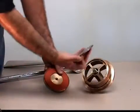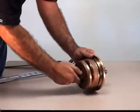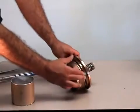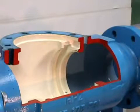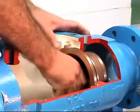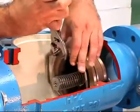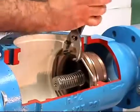When reassembling the check valve, make sure to replace the stainless steel washer with the double side facing the silicone disc. You must also apply an FDA-approved lubricant to the check O-rings. After the check servicing is fully completed, simply reinstall the internal parts. Begin by lowering the check into the valve body and firmly pressing it into the groove. Lower the spring clip into the valve body and squeeze the tabs fully together with pliers. Completely fit the spring clip into the groove before releasing.